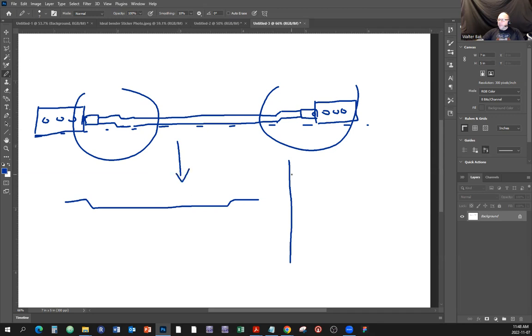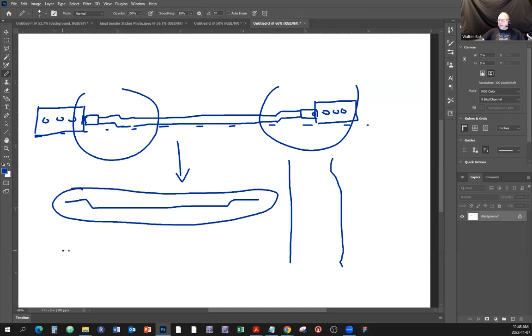The finished pipe shape will have two small offsets, one on each end. You also need to properly align both bends - if you look from the top it should be straight. If things aren't aligned properly you end up with a dog leg. That's the technical term - if a dog's leg is bent, that's what it looks like. You need to position the pipe correctly in the bender on both ends so everything aligns properly.